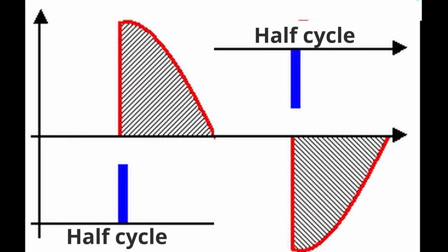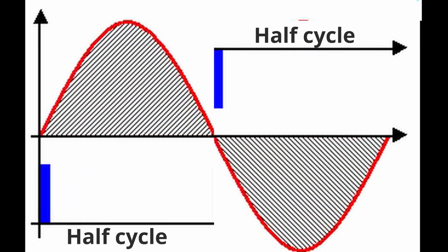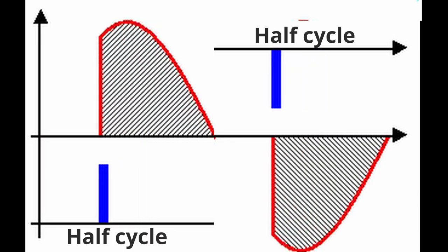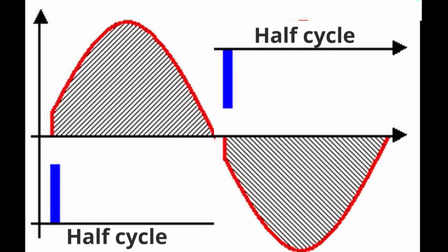I will divide the length of one half wave by 100 and use each increment as 1% of intensity. Because the wave is sinusoidal, each increment doesn't actually represent 1%, but the difference won't be that big, and for simplicity's sake, I'll leave it like that.